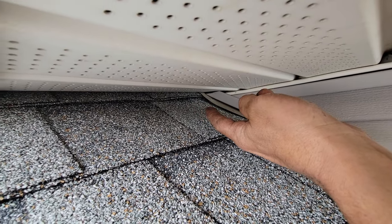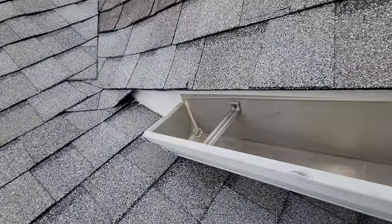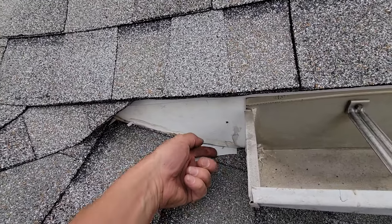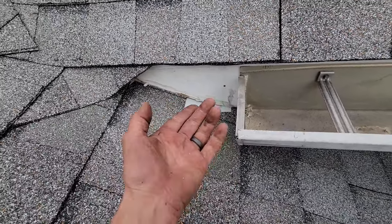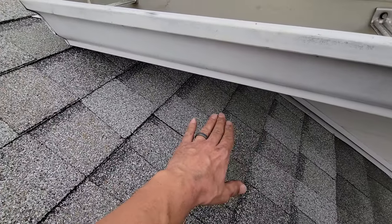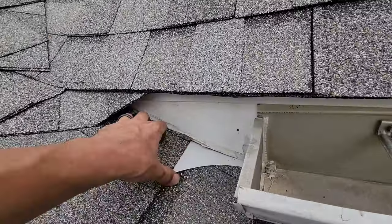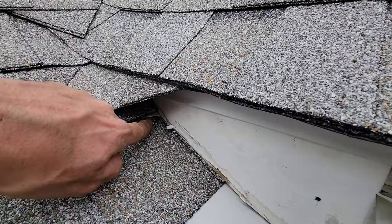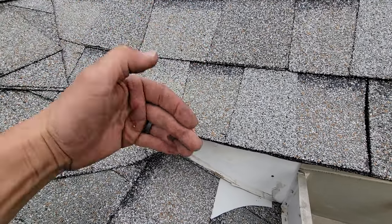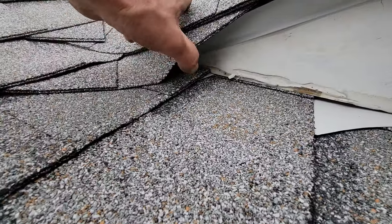That one up there is too. In the very rare case water runs down and misses the one above, I wanted to hang it down a little further and I left a web. You could have cut this and tucked it under, but then that would slice the nail here. A tip when you're trying to run up under a tight area: do it to where your nailer and palm nailer can't reach, then stagger out a little bit of full shingles up under there. That was doubled up — there's another piece on it to go higher, another piece of flashing up in there. There is flashing behind the fascia metal, coming up on the roof deck and bending down over these pieces. That goes past the transition. Another piece of flashing I put up on top of that — you can't see it, it's up under there.